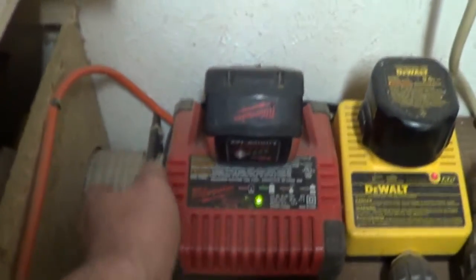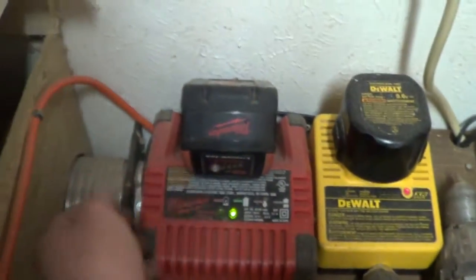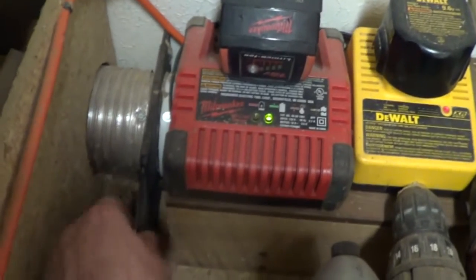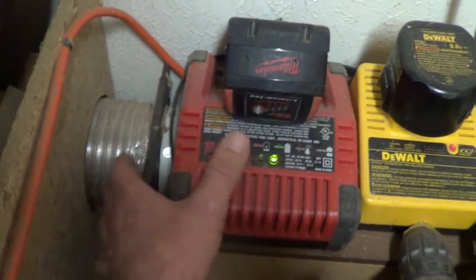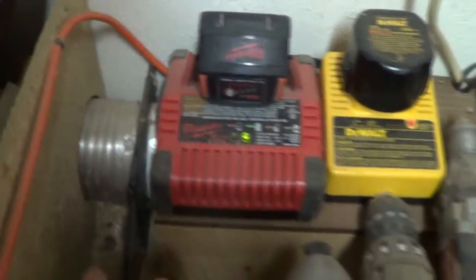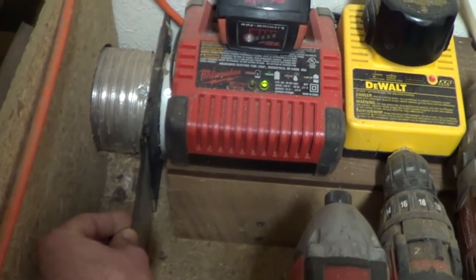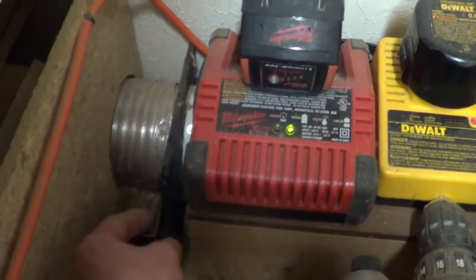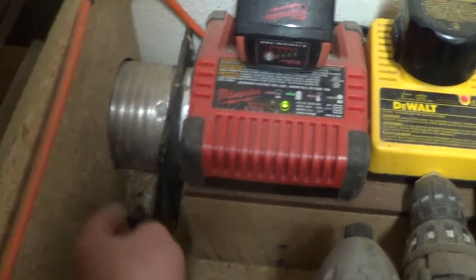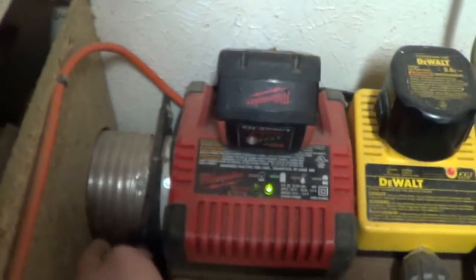Over here at the charging station I use one of the cheap gates, because there's no protrusion through the other side when the gate's closed, which is good for a situation where you're against a wall. This is the open gate, and this is the closed gate. I do have to clean this one out occasionally, but not that often because it only controls my sanders and the dust is very fine. For something that throws a lot of heavy particles, a cheap gate is a disaster. But for sanding dust, it does fine — maybe once a year I have to mess with it.